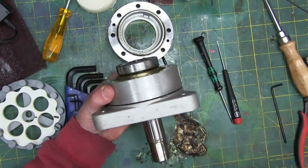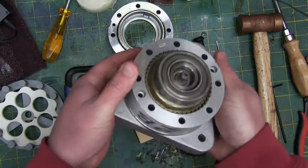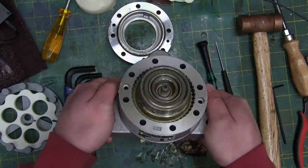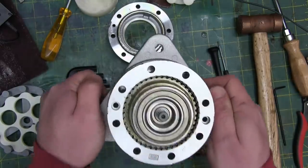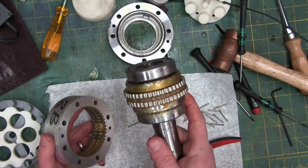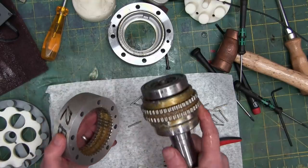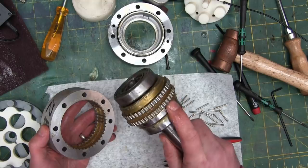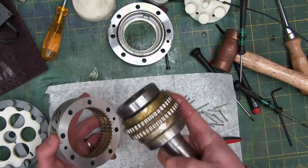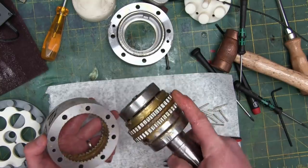We tap it in. Wood — not just for birdhouses anymore. It makes sense now. It's offset 180 degrees. So you got to pull out some of the pins. That's the gear there — the two cycloidal discs. As I said, there's two of them in there to minimize the vibration. If we only had the one in there, she'd be walking all over the place.